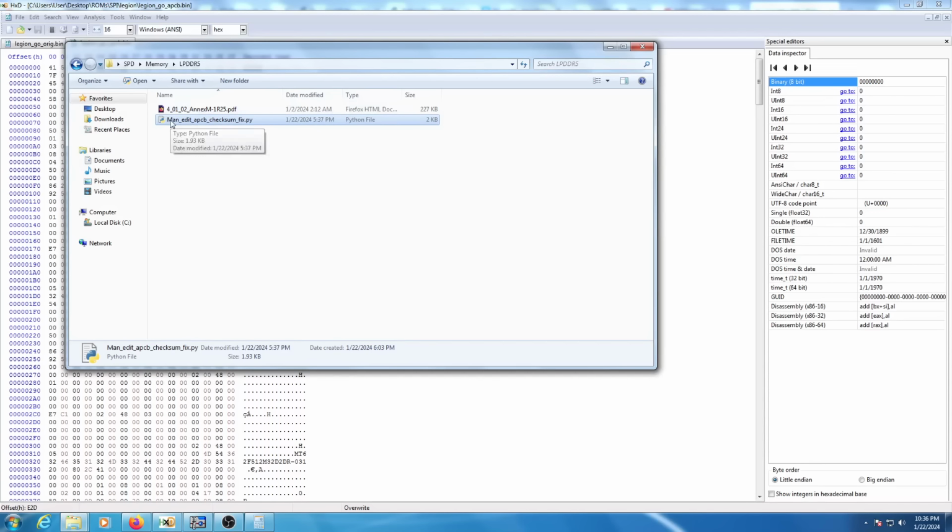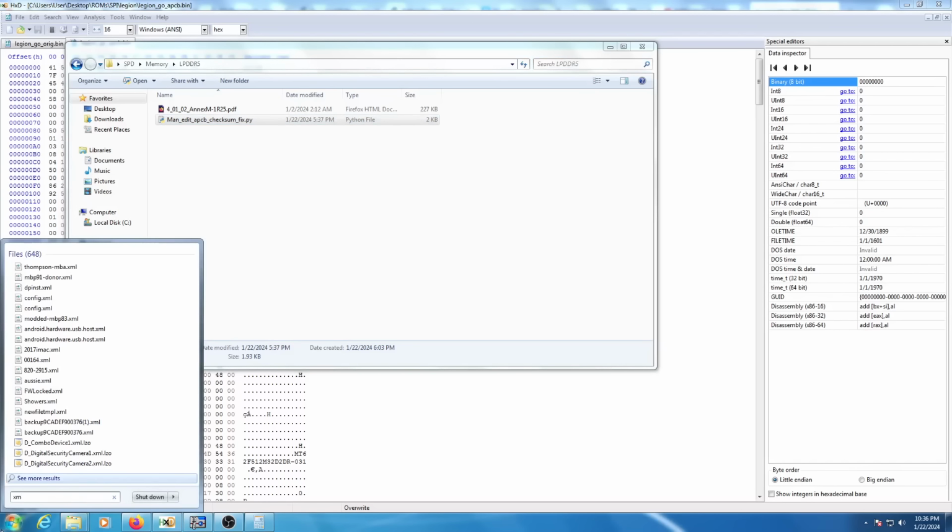but this is an implementation that someone has made to do this same operation with the ROG Ally mobile PC, but it works just fine with any AMD system BIOS APCB file like this. And it was actually derived from a file created by some of the Coreboot developers. It's located in the Coreboot repositories. So in order to use this, we're going to open up a command prompt.